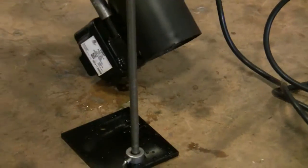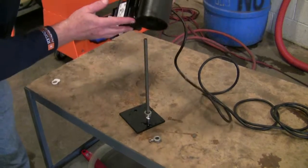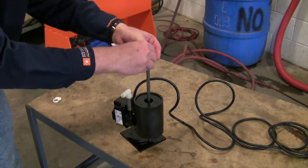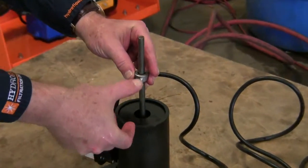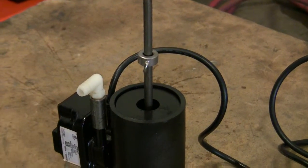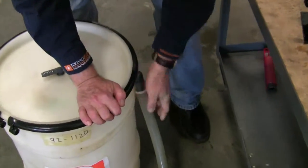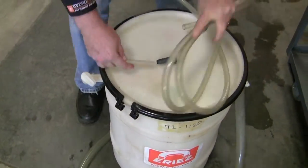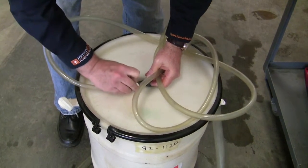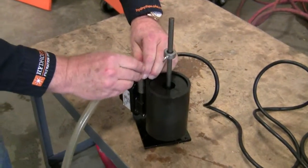This can be used in a number of different sumps, probably up to about 9 inches. The way you adjust it is with these collars with thumb screws — you slide the assembly on and that holds it down. You want this piece here so the top float won't float away, but it has enough room to give as much movement as possible. When it comes time to install it, you get a hose to stick onto the discharge — it comes with a hose to go from the pump to the drum — and give it a little clamp to hold it there. Then this piece goes on the barb on the pump and skimmer assembly.